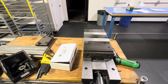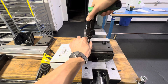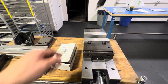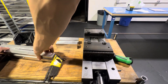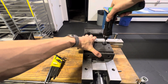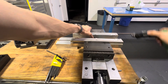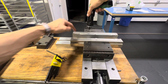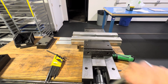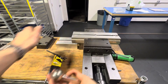Before I switch this out to the pallet, I want to show you what it looks like if we're going to a different job — I'm going to bring in what I believe is the Lander 1 setup. I'll take these out real quick. So here's a 12-inch jaw — they sell six, eight, and twelve. I'm just going to shimmy this until I locate it. Boom, just like that. And then that goes in just like so. For your reference, Orange Vise sells these blanks so you can machine into them. Once those are in, we machined it so we can locate it — that's our origin right there, and it's repeatable every time. And then boom, you're going to clamp two Lander scales, one left one right.